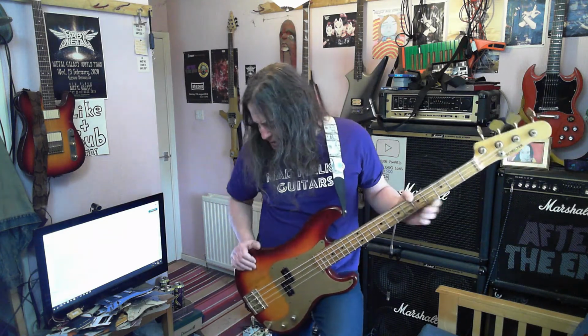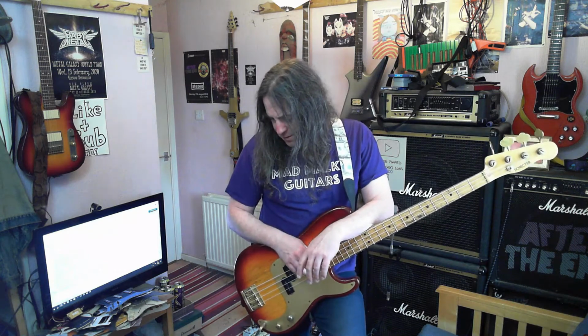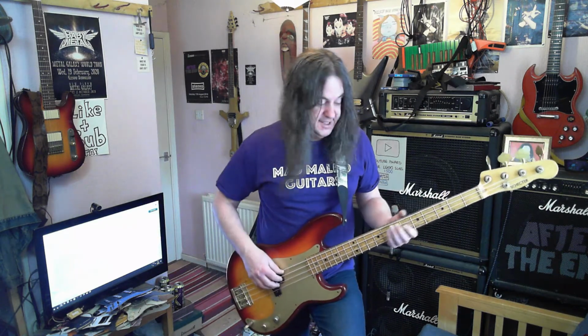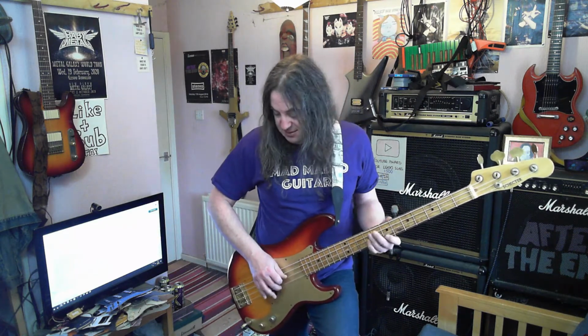I wonder if there's some way of putting a... Yeah, I suppose you could put a volume control on it quite easily. Just put it in series with a volume control in the boost circuit, so that you could have it set to a set amount rather than it just being the set 6 decibels.